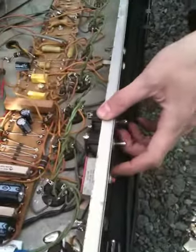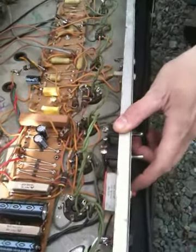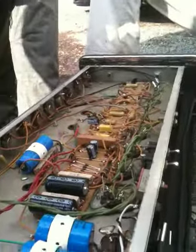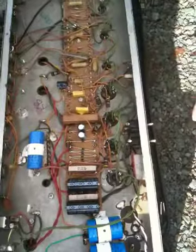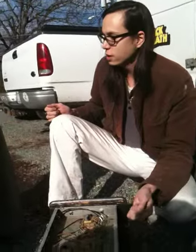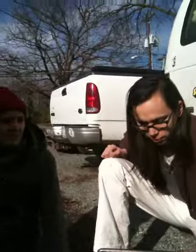And then if it's still blowing, I would also wonder. After a while, a fuse can go bad. Like a fuse box switch, that could just get worn out too. Between the filter caps dying, that can make fuses blow. Your tubes are weak, that shouldn't make a difference. Oh, they were covered with like mud. Really? Yeah, there was full-on dirt all inside your amplifier. I had to scrape it out. A layer of like a hard rain had shot up orange dirt, full-on orange dirt. That was weird.